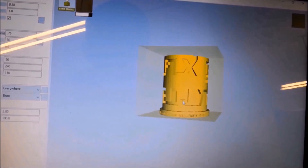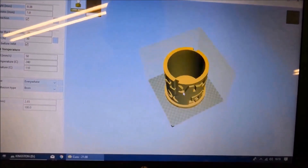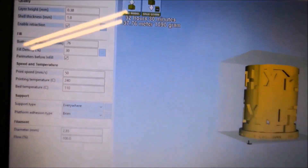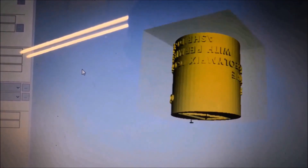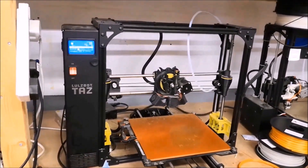It's spelled Geolympics, which is a mega event here in the UK — so this is who this cache is for. It's going to be a letterbox hybrid released on Mega Day. I've put the fill density up to 30% and changed the support type. The time it will take to print is 32 hours and 30 minutes. Well, that seems a bit long. I'll check how long the other print will take — it's got all the lettering wanted by the organizers, and the letterbox hybrid logo on the bottom. That one's another 35 hours, which is too long, so I'm going to have to rethink my design.